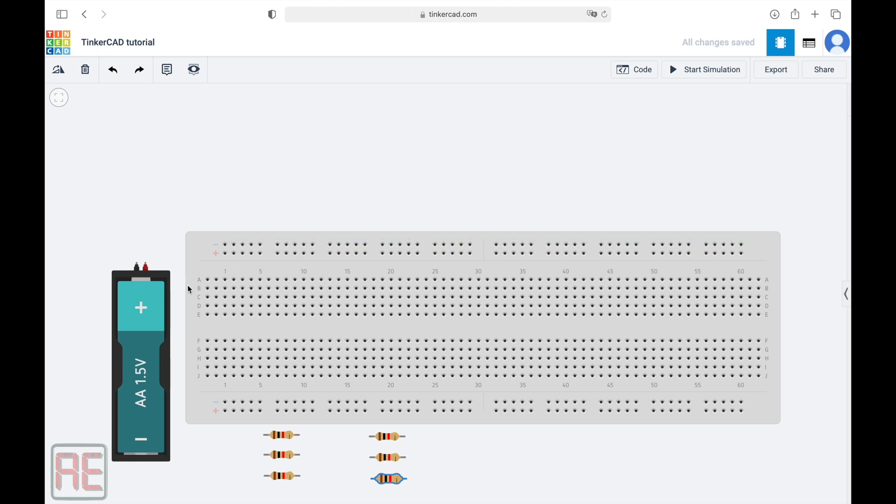On the matrix of points down below, that has labels represented by letters from A to J, the points are connected in columns. For each column, all points are connected, and every column is separated from each other. The same happens on the region below — all the points here are connected in columns. And again, on the lower line, we have the same connections as the top line: all the points here are connected in a row.